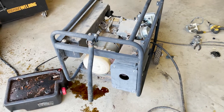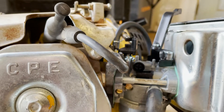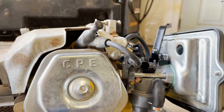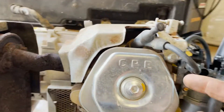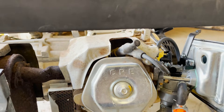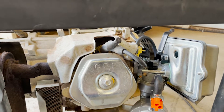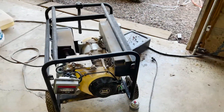Alright. So that's the propane conversion kit. The little mixture screw I was showing you is right there, and it's just a feather adjustment. I'm going to check on the health of the engine from this being neglected and make sure it hasn't sat around too long. Make sure the valves aren't rusted up, and see if that stops the hunting issue. But other than that, got it — it's running. It doesn't seem like it's as much of a fire hazard anymore.